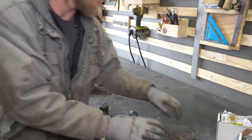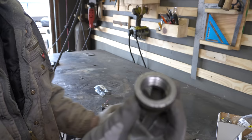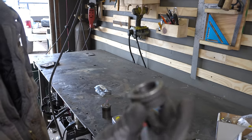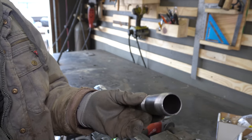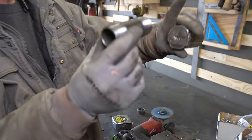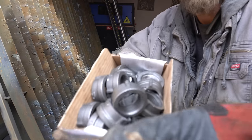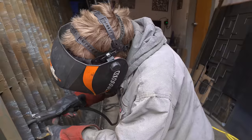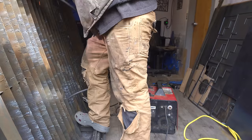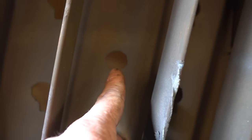While we wait for those to dry, we need to figure out a way to affix these to the machine. To do that, I got a bunch of gas fittings, which we cut in half to get a little stubby that gets welded on the machine. Then we take a nipple and cut a length off it, which gets welded to the back of the electromagnet. We take all the cut couplings and weld them to the bed of the plasma cutter, lined up over some of the holes that were cut in there so we can pass the wires through.